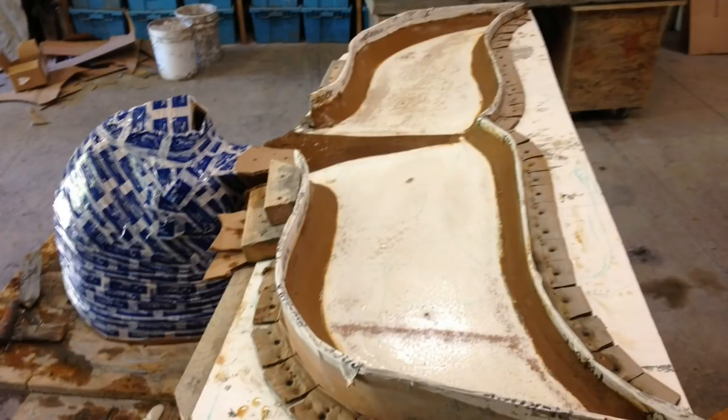To partially limit the need for so much grinding, I further modified my form with clay to more precisely form the underside of the fin as I shaped the top side with a trowel to make the radius of the top as I applied the mud to the casting, which virtually took away all the need to grind or cut away so much excess mud, as was the case when I just filled the form full of mud.